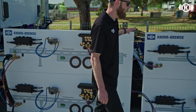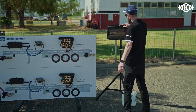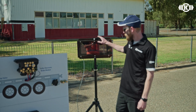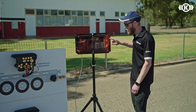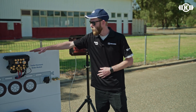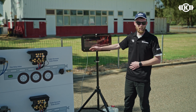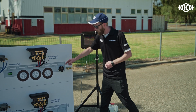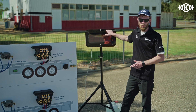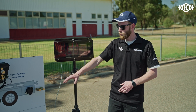Coming down the brake boards, we've got a timing display at the end. The two pressure sensors are wired into this timing board — a couple of lights will show which brake module actually applies the brake first. If the top one applies the brakes first, the red light starts and begins the counter. Once the bottom module applies a brake output force, it signals the counter to stop, showing the time difference between the CAN brake trailer at the top versus the fully pneumatic signals at the bottom.